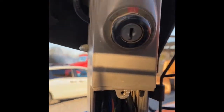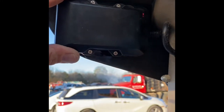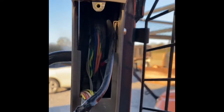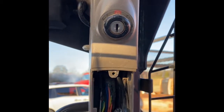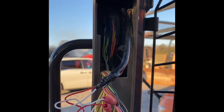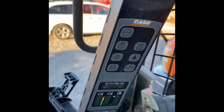It'll still get a great signal and you can still see the green light just flashing away — out of sight, out of mind. This will all go back together really nicely. You can probably get to the back of the key switch up there, but it's very awkward to get to, so I went for the simple method: self-tap to ground right behind it on a metal post. That's pretty much it for the Case TR270.